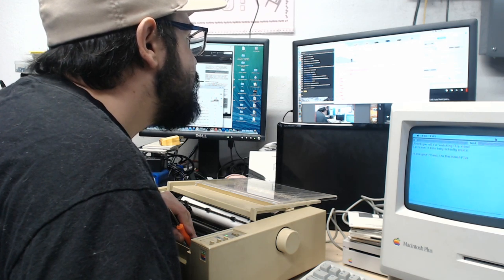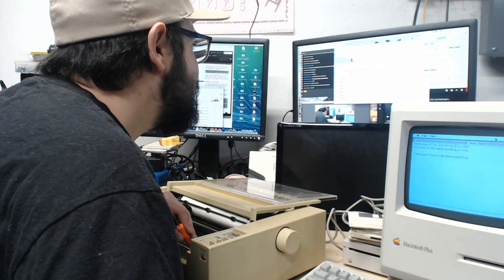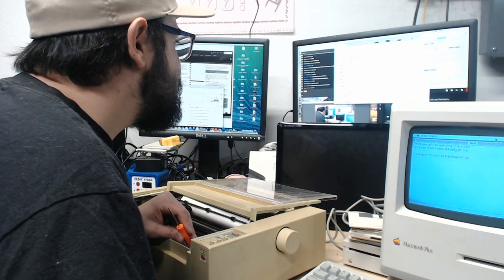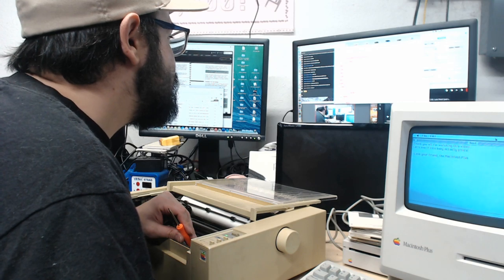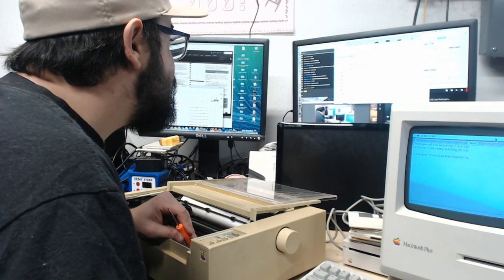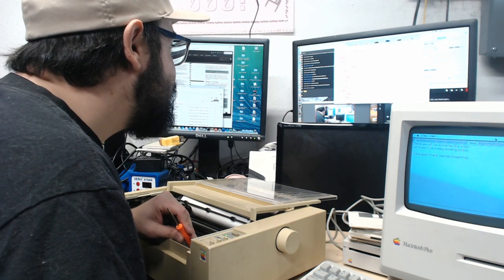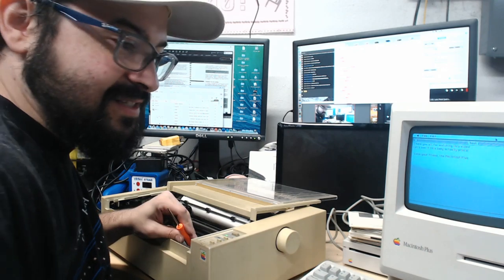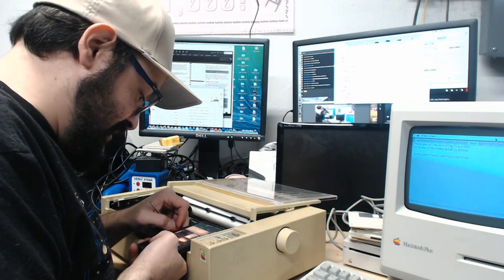So normal dip switches are indicated by the bold-faced letters. Okay. I'm assuming the switch up means it's open? It's very difficult to try and see this here, but let me just continue looking. Let's see, switches 1 to 3, okay, that's 1, 2, 3. Switch 4 is the form length. Switch 5 is, well, let me take a picture of this before I start flipping switches, because even if I mess it up further, at least I'll know where I started from.